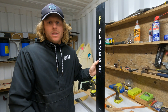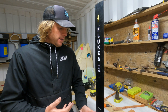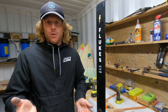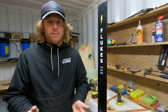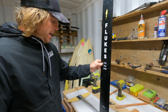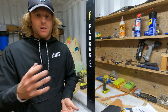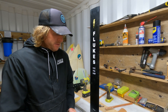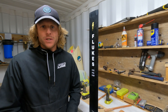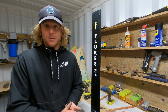You can make the same thing out of foam, out of plywood, you could wrap the whole thing in carbon — there are so many options and you can do whatever you want. The purpose of these videos was just to share how I do it, and then you can go out there and modify it however you want. This modular setup using the production mast and aluminium fuselage means you really can try multiple approaches. Once you've built the first one, go and try different wings, different layups of fiberglass and carbon, different cores, different aspect ratios, different thicknesses — that's actually part of the fun.